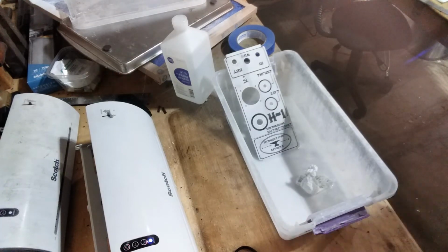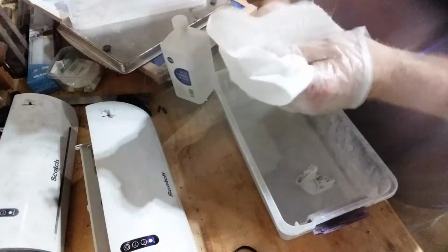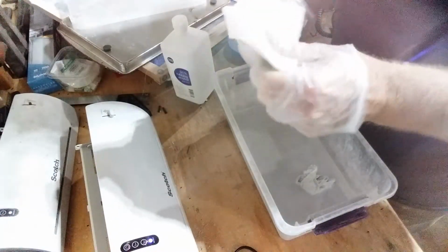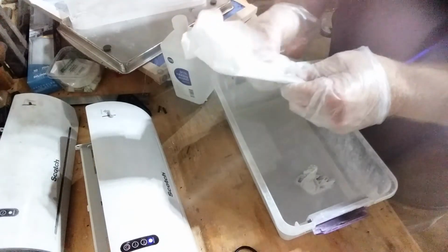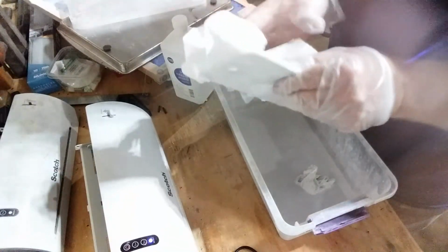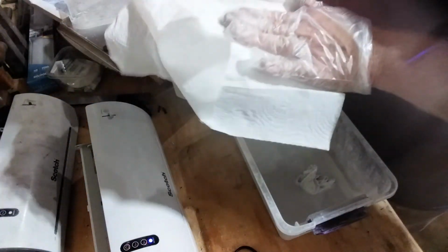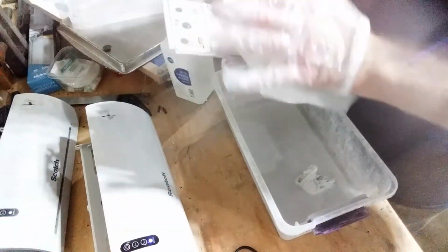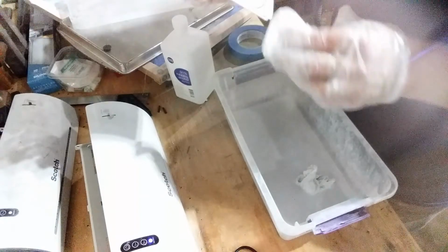Like I said, I use this exact same process for PCBs, and it works great. You've got to fuss a little bit more and be a little bit more delicate with PCB because you're using such fine lines. The bolder your lines are for toner transfer, the better they transfer because they're not as delicate.